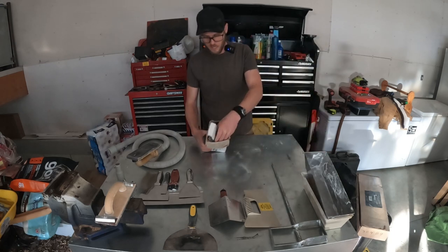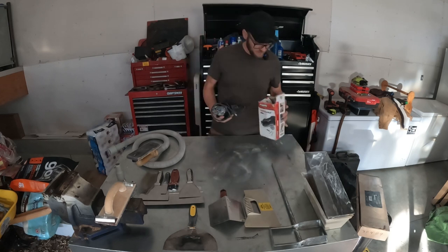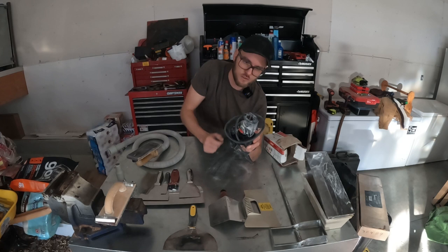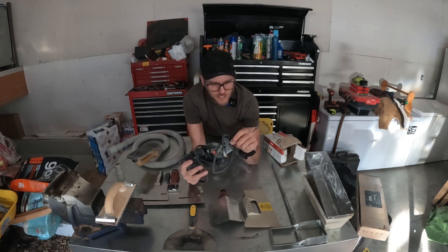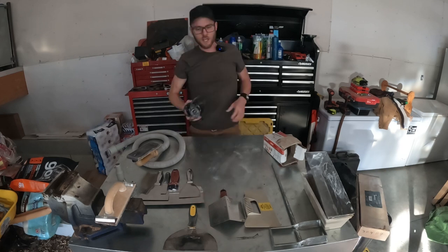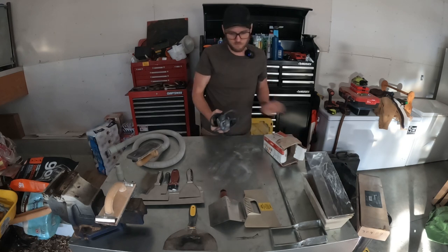One of the few tools here that is not cordless — because I don't do drywall for a living all the time, so I don't mind an extension cord — the Rotozip, a spiral saw. This strictly has a drywall bit with a pilot on the end: about a quarter inch with no cutting teeth. When you're putting your board up, you don't measure and cut around every single electrical outlet. You mark a location, plunge in, move over until you feel the side of the box, buzz around, pop — it's a perfect fit.